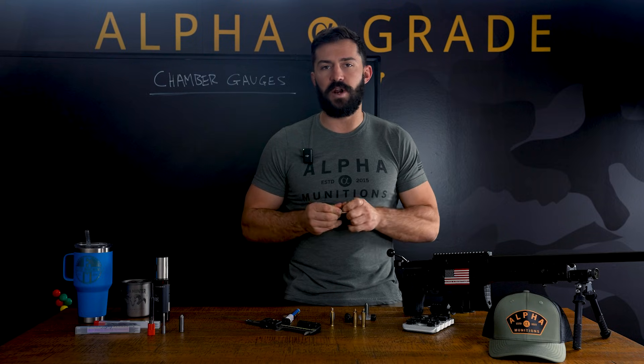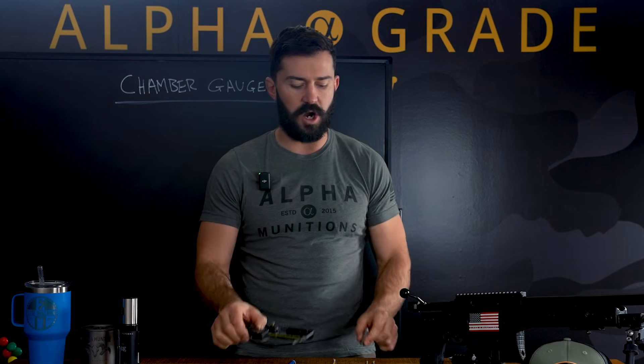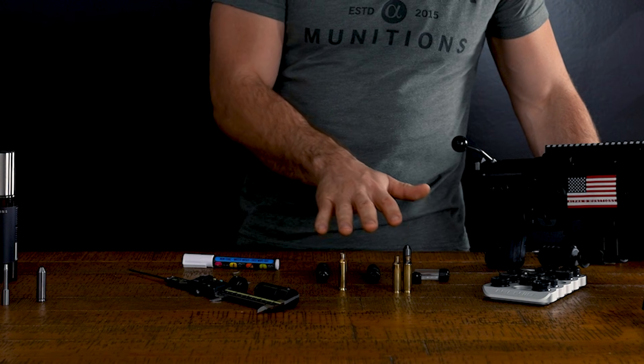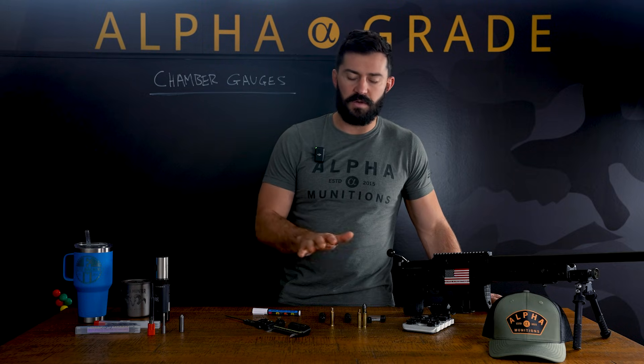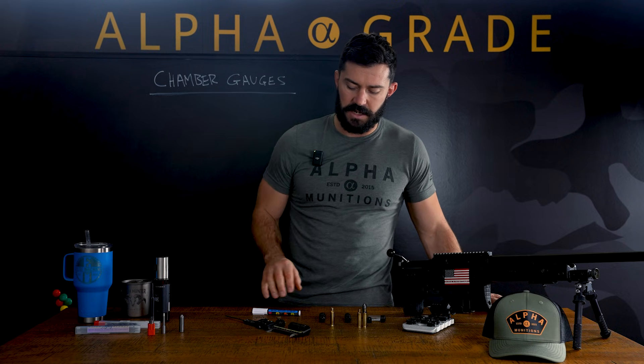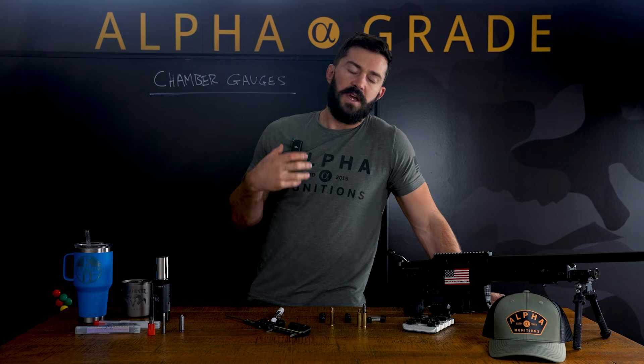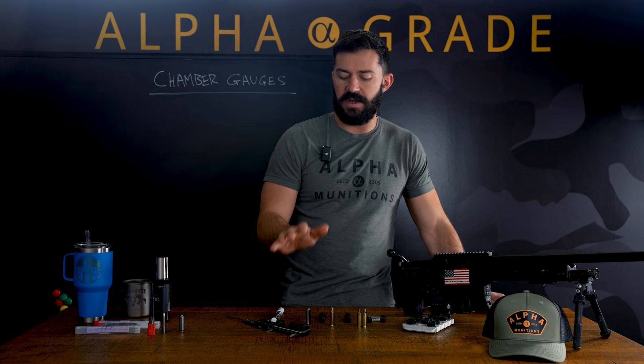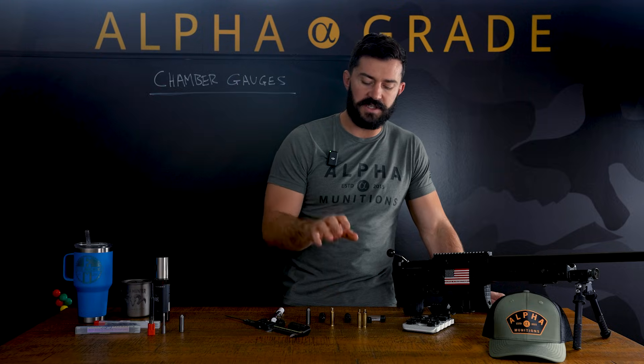One of the other aspects of what I like to use them for is I like to check our growth. And then also we can check and use these as a datum or a zero for our cartridges. For this example, I have our 6.5 Creedmoor brass. We just fired some through our AI rifle test gun at pretty high pressures and just did some duration testing. And I wanted to show how we use these tools to determine the length of our chamber and determine how accurate our measuring devices are.